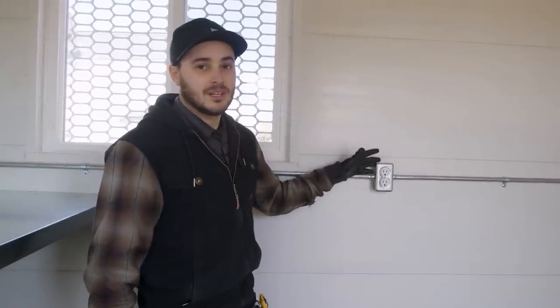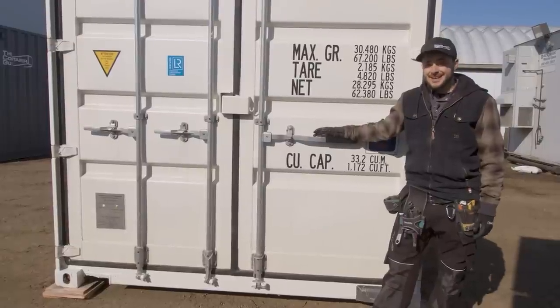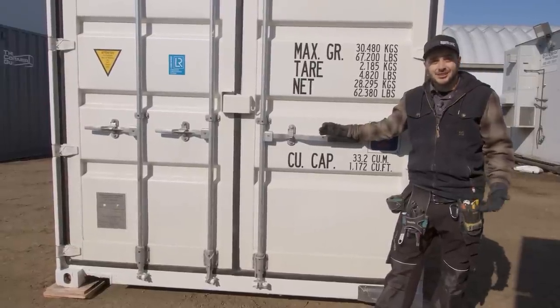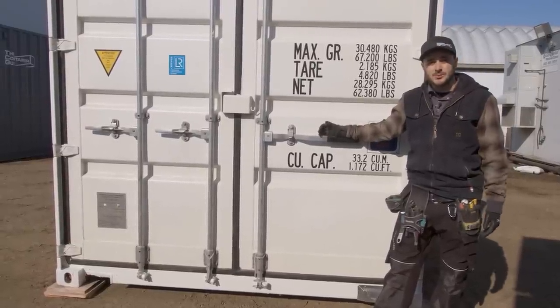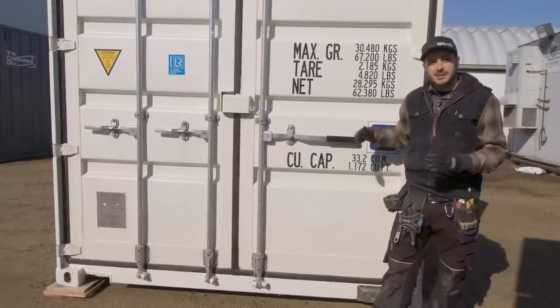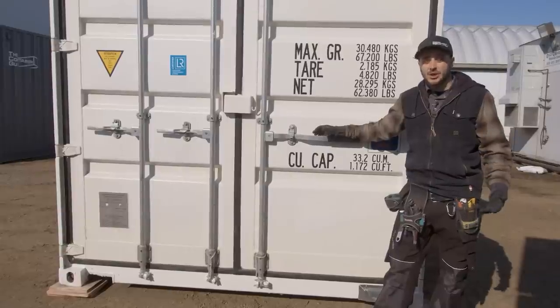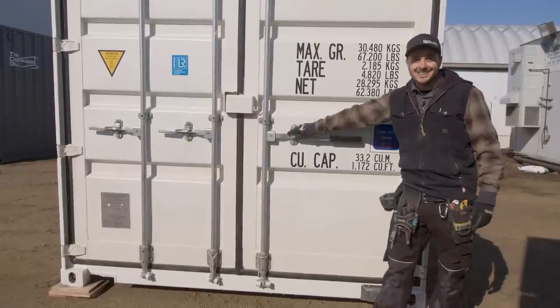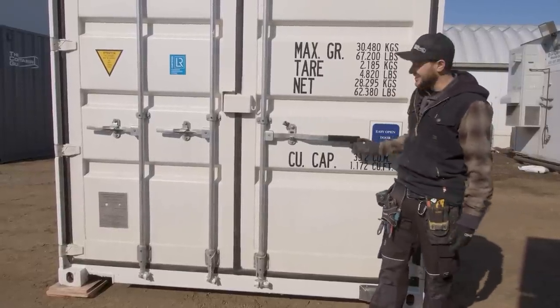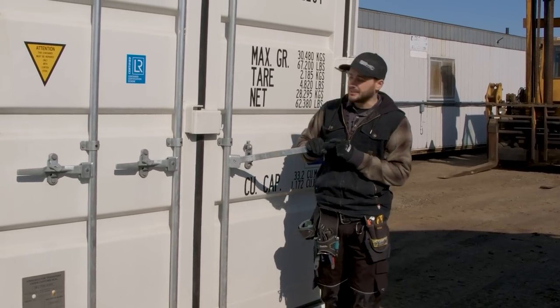We've used the white PVC reline wall panel — it's a really nice finish, very easy to clean, durable, and reflects light so well that even just a 12-volt LED strip is bright enough, especially when it's dark outside. We've also run 120-volt power in here; the customer won't be using it at the first location, but in case they move the scale shack to somewhere with available power, they'll have 120 volts. Travis has piped all this in with galvanized pipe, which makes it fully editable — they can move anything, pull new wire, and change things up. If it were buried in the spray foam, it would be very difficult to change, so it's a bit more expensive upfront but much better for the user long-term. Over on the storage side, shipping containers are great for storage, and this is an office storage combo.